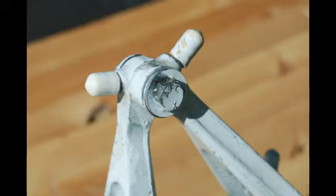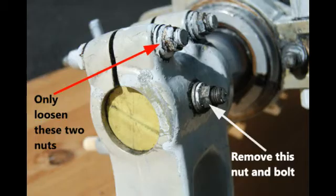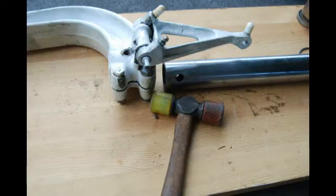Here's where we separate the knees by removing the bolt. You remove the axle and the fork assembly from the piston by totally removing the one single bolt and loosening the two at the top there. Using your rubber hammer, hitting the fork assembly and driving it off the piston.